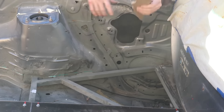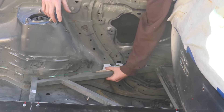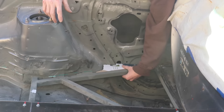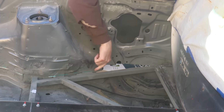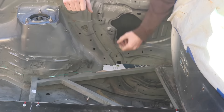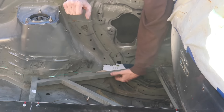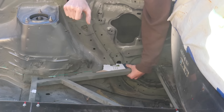The last thing I'm doing tonight — I got these inserts because this area right here isn't going to have a removable panel. I tested the other side as well and it fits pretty perfectly on both sides. I'm going to grind this area out and cut two of these. On the back side I'm going to spray some weld-through primer so it doesn't rust on the underside, and then I can go ahead and weld this in.